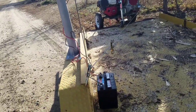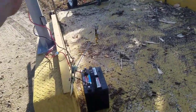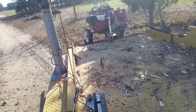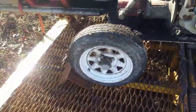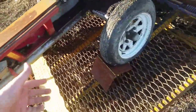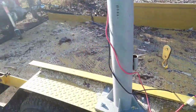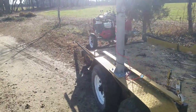I could have gone a little heavier on the blocks and probably done a 4-to-1 with the setup I've got — I'd actually have to do the math — but I could rig it even better. Let's try pulling this some more. This tire's flat, and I think this Timberwolf weighs about 1,500 pounds, and the ramp over here is down and dragging. This is definitely not something you could do by hand — it'd probably take about six guys. It goes to show what a little bit of angles can do for you. You can see it's actually dragging.